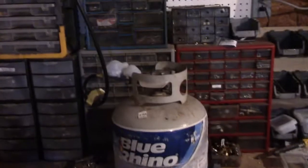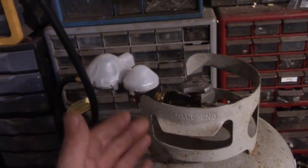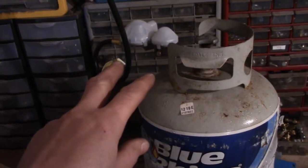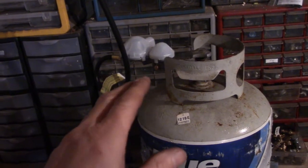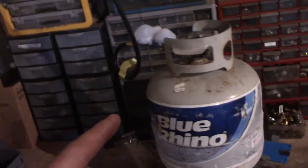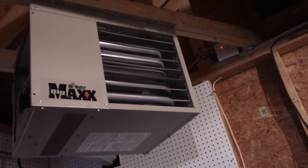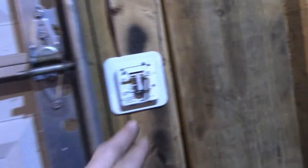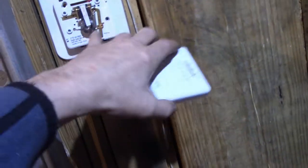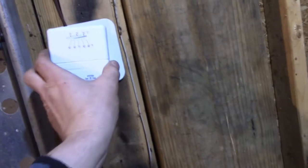I walked over and took off the face plate on the thermostat, and then it started working again. After running about 30-40 minutes, I noticed it says 'remove' on a little stem inside the thermostat. I think the face plate was pinching this mechanism so it couldn't work. I went through the English directions — nothing about removing that tab. This cheapy $20 thermostat at Home Depot — I was looking for the old dial kind. What I did is, I just touched that stem and you can hear the furnace kick off — the flame actually went out just from touching it.